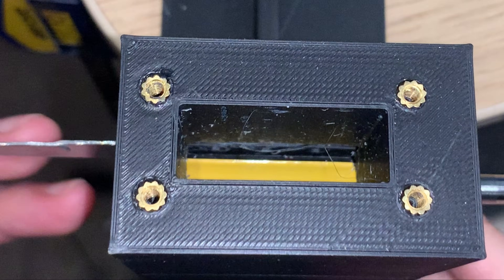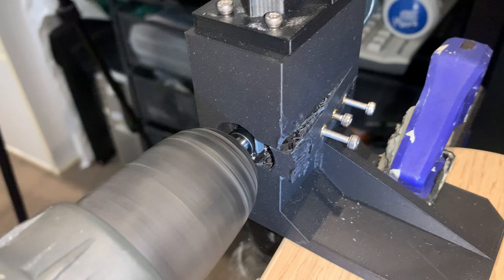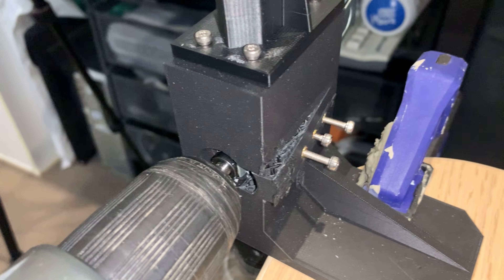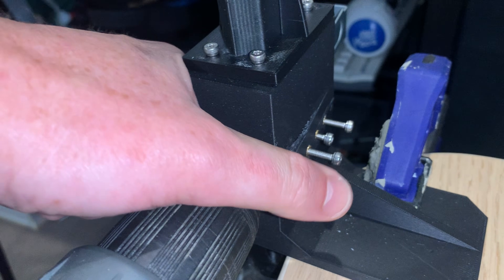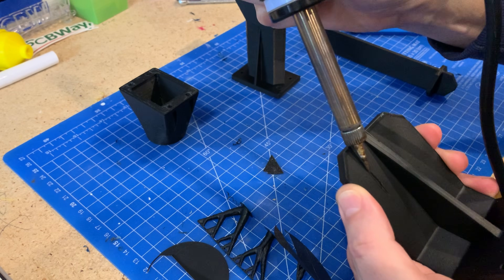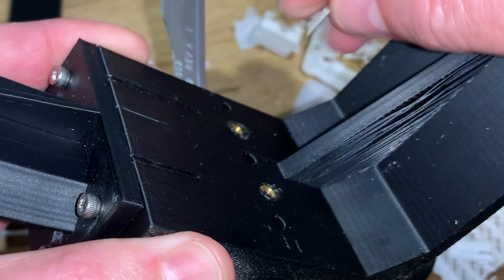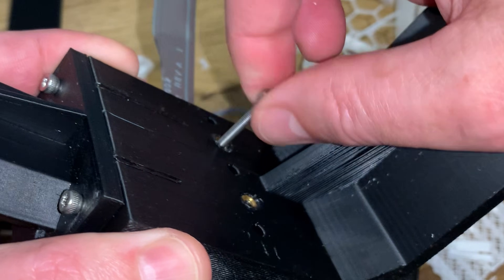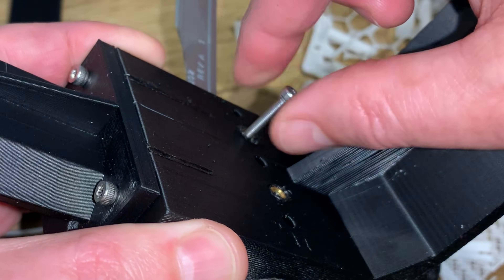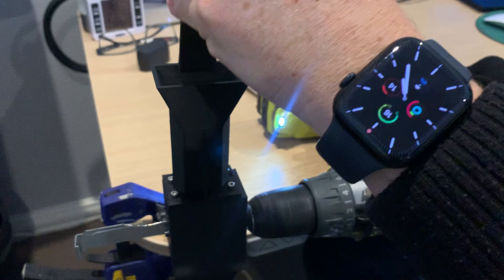While that metal part was now strong enough, I managed to blow out the back of the main body — probably by overloading the amount of scrap I was feeding in at once, but also that body probably wasn't printed in the right orientation. So I tried the original that I had some layer separation going on with. I made sure to get those bolts and the metal shield as close as possible to the router bit, which really ensures that chunks don't get caught as far down and put too much pressure on the metal and blow it out.